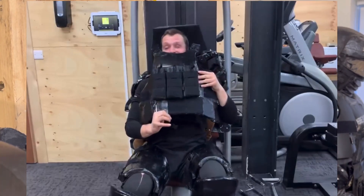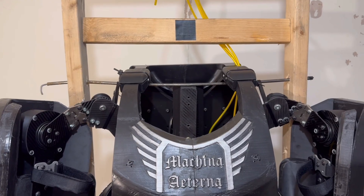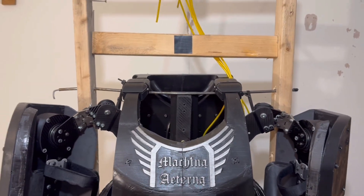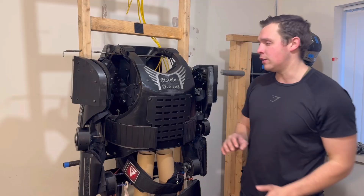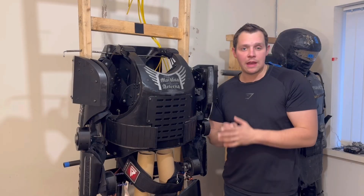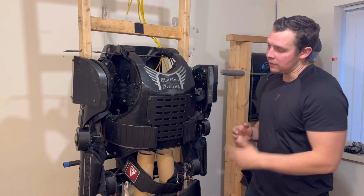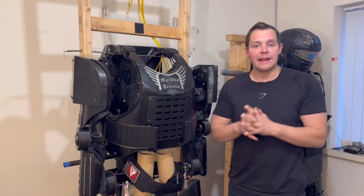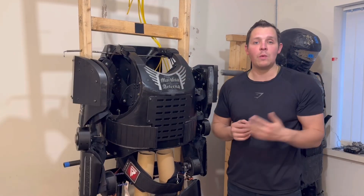For the attachment points at the top, the chest plate slots down on top of brackets and then you attach the velcro at the bottom. These are currently just cable-tied together because it's extremely difficult to put all this on the standing frame — I didn't design this system to be stood up, more to be laid down in the back of vehicles. This system works better than a hinged plate because a hinge makes it really difficult to physically put on yourself — you'd have to lift the plate above your head while inside the exoskeleton. I've also got some attachment points for any gorget that might be added in future.